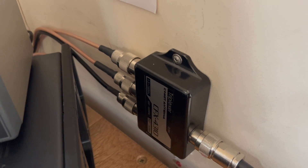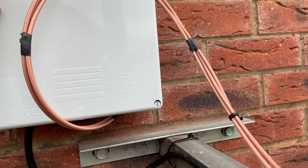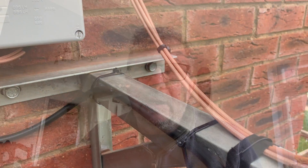I'm quite a happy bunny with all of that. The three beams are up and working well, the control cable is plumbed in nicely, the coax has been fed down the wall nicely. I've got a triplexer on the antenna side and another triplexer on the shack side. I used RG400 - the copper clear-jacketed cable visible at the top of the pole - as an addition because I lifted the pole up another five to seven feet.